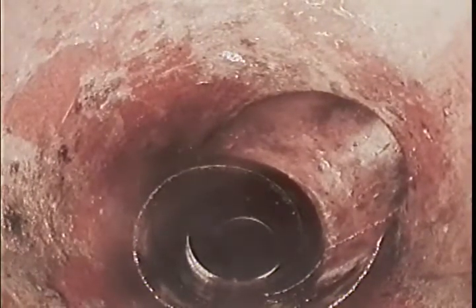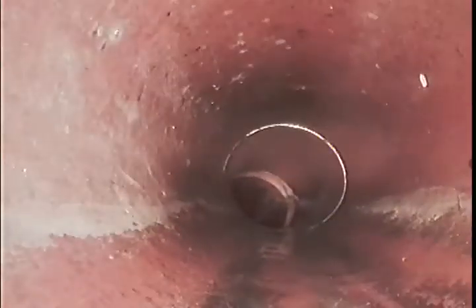That's the first branch that we've just done, which means slight dislodgement there. Our kitchen gully trap comes in, circumferential crack there. That's our kitchen gully branch right there. We'll stop recording, we'll get this marked out.